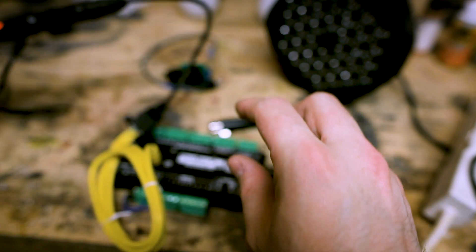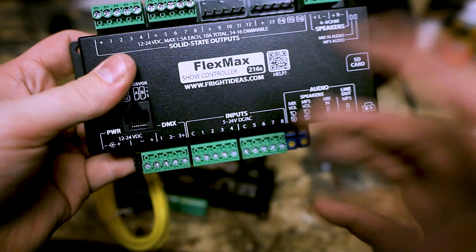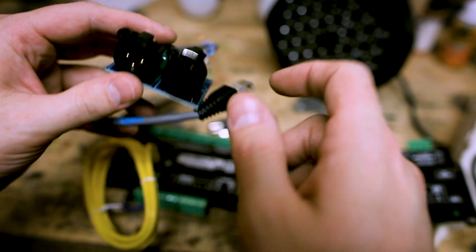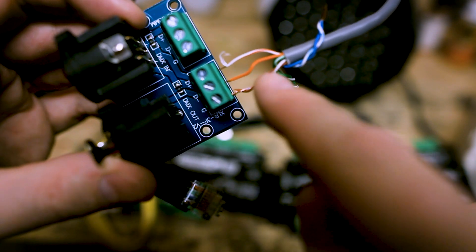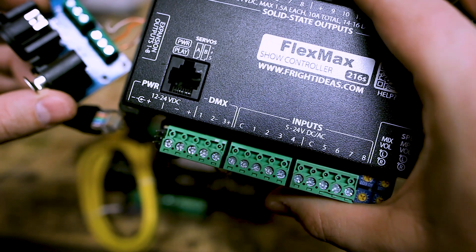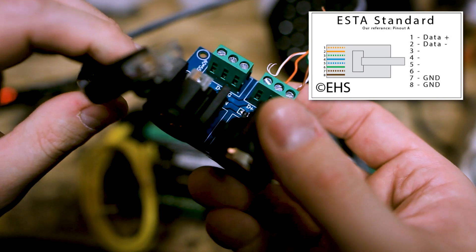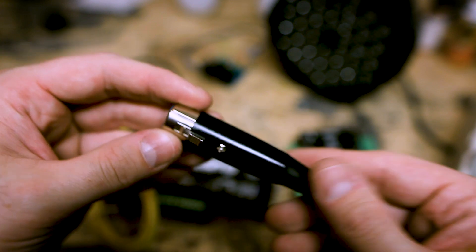If you are not using a FlexMax 2 and are still on the old FlexMax 16S, you're going to need to wire them up to this port here — the instructions tell you how. This is a DMX Ethernet adapter with screw terminals so you can do in and out. The brown twisted pair is wired to ground, the orange is wired to D-negative — or pin two negative on the old FlexMax — and over here is D-positive, which is pin three positive on that old FlexMax. That's the wiring standard using the Ethernet cable. You can make your own cable or just buy one of these adapters.